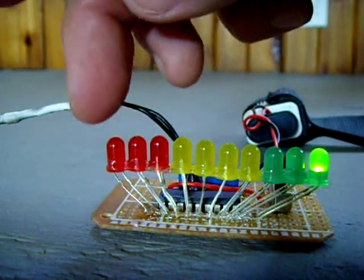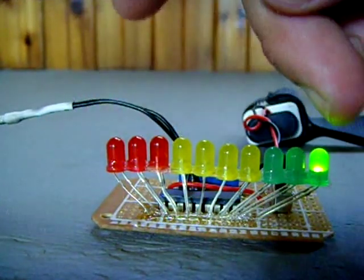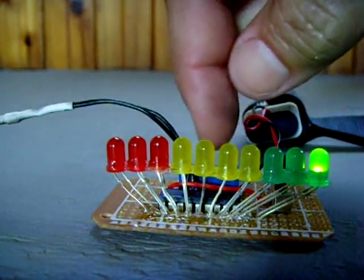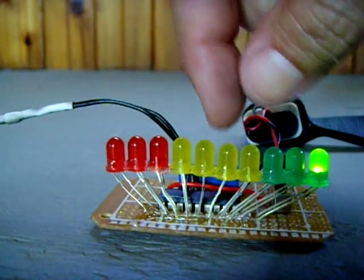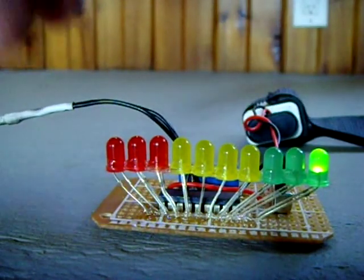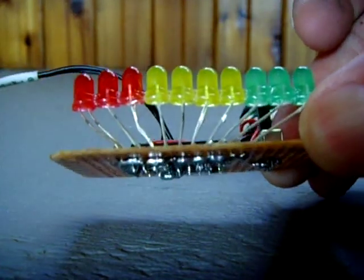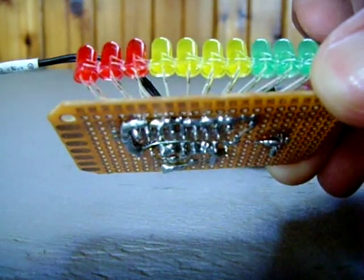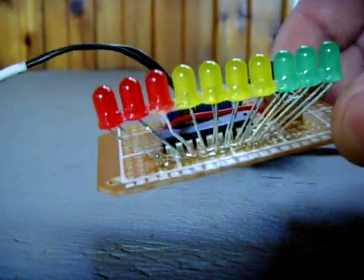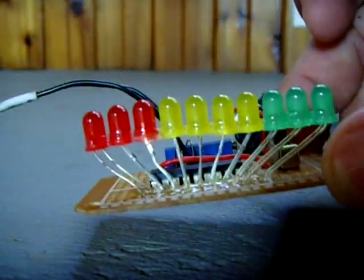It's very hard to get the last LED to light — you need a lot of heat to get that last one to come on. But all nine LEDs go up and down perfectly smooth. You can adjust the whole range by turning the potentiometer, or by changing the value of the potentiometer and the value of the thermistor. Pretty compact and a lot of uses — check it out in the description box.